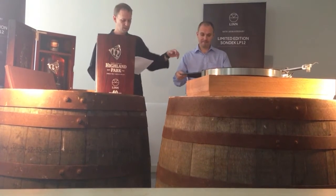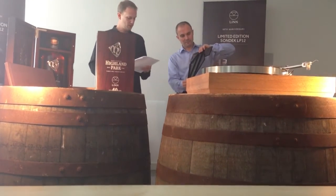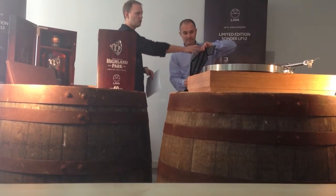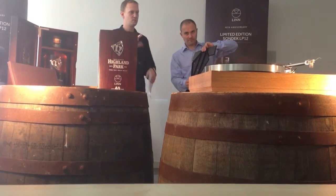The armboard and the sub-chassis are mounted together in the current design with three screws. This assembly has the potential for twist because of the small contact area between the two parts. And it's also in the centre, so where we're putting the arm is off-centre, and there's the potential there for moving.